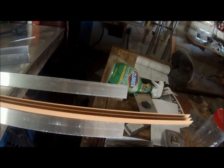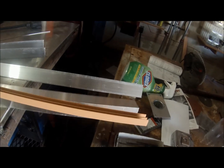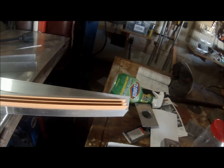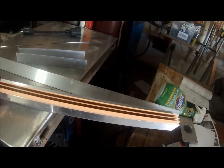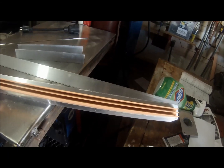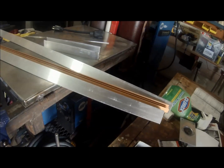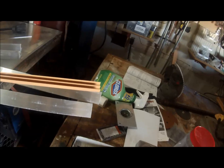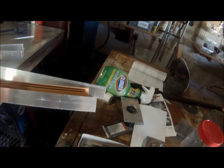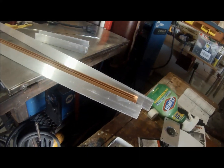Ultimately this window is going to sit in a hole, screw on the outside, and then we'll put this track in so the windows just slide inside of it — that allows a really smooth operation. I made some windows before totally out of wood and they worked, however the problem is with moisture they swelled up and I couldn't budge them. Even though I had routed them out even bigger, the expansion just wouldn't let them work. Hopefully this will keep from expanding — it's solid plastic and aluminum, so no moisture issues and real smooth operation.